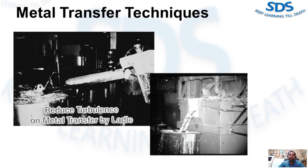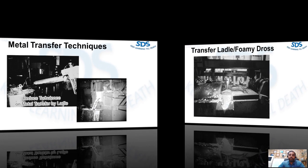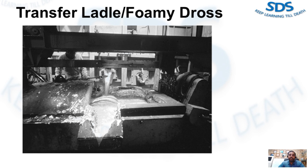The advantage of a pressurized system is that there are no moving parts. If nitrogen is used to pressurize the chamber, oxidation is minimized and maintenance is reduced. A non-pressurized system with a broad pouring system creates excessive dross through turbulence due to gushes and excessive pouring heights, and should be avoided.